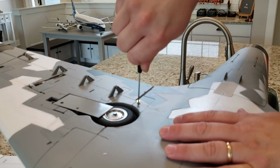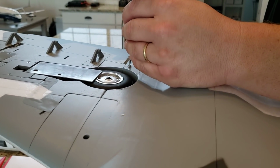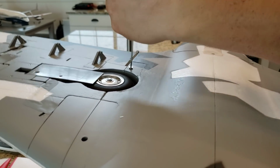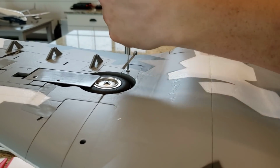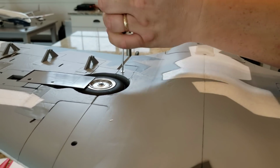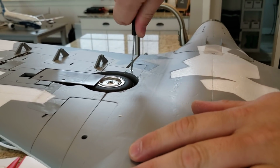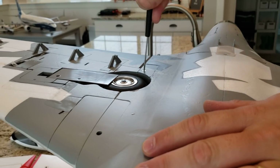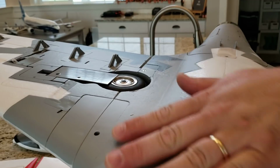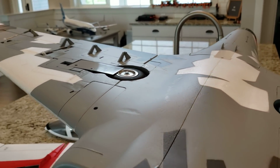And that's gonna lubricate the screw as it goes in, hypothetically. Do you hear it's not squealing at all? I probably need a little bit more Dawn because it's gonna squeal at the end, I bet, right before it finishes. Usually when that happens. So dip the tip in Dawn and you'll be very happy. All right, so sorry, I just hit my mic. Hopefully that wasn't too egregious.